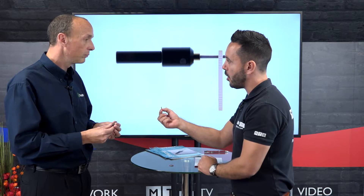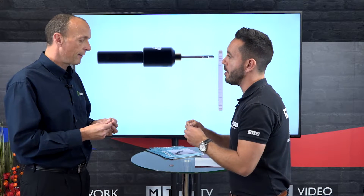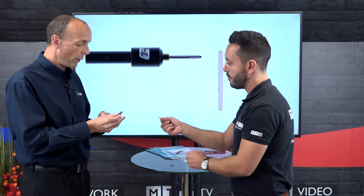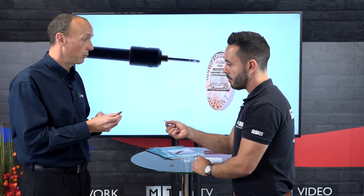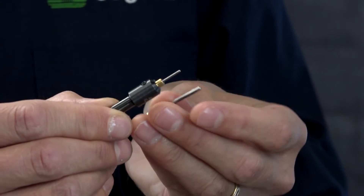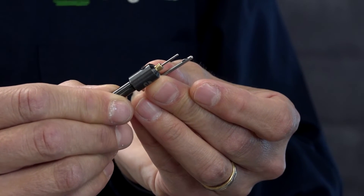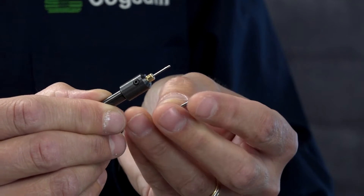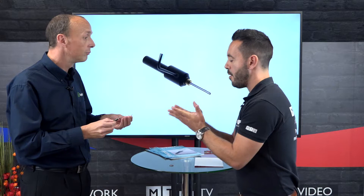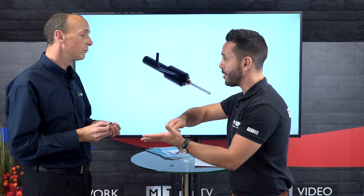The configuration of this tool — you've got a cartridge that fits into the cartridge body, which is slightly different to the standard burr away tool. The burr away tool has a replaceable blade, whereas this has a replaceable cartridge. Instead of replacing the small blade in the arbor, you take the screw out, the cartridge comes out, and a new cartridge goes in. So apart from being able to chamfer a hole that's nearly impossible to chamfer front and back, it's going to save a lot of time and potentially a lot of scrap.